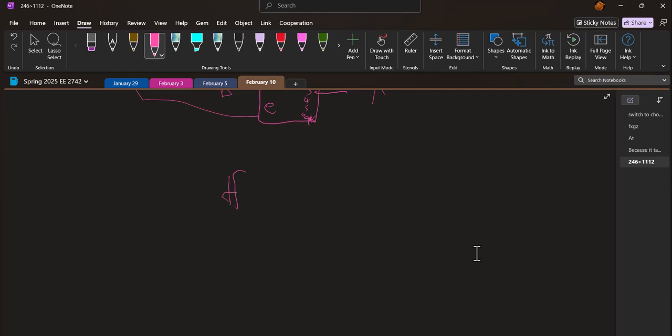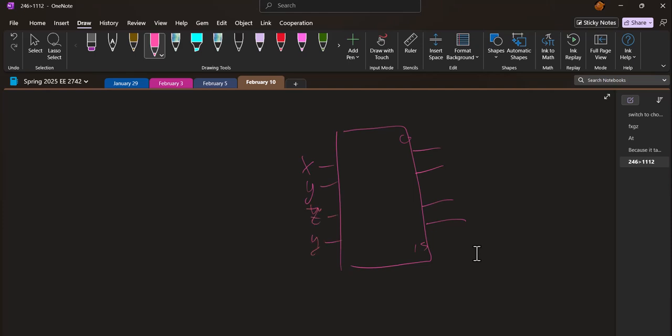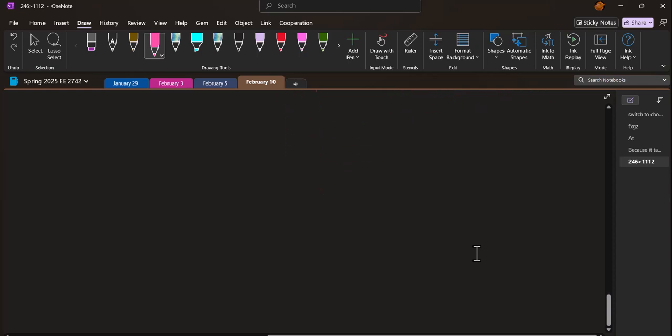Starting from the beginning, let's say I have a function that is the sum of some minterms, 1, 3, 8, 9, 11. Like I said before, if we had a 0 to 15 decoder, all we'd have to do to make this function is to put our 4 variables in, and then OR together the minterms, and that would be our answer. So how are we going to do this one?